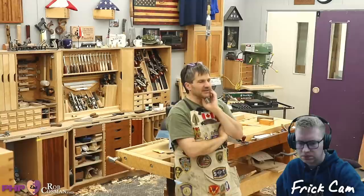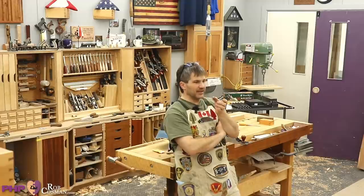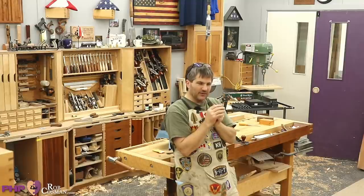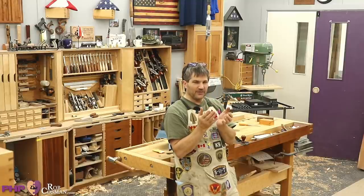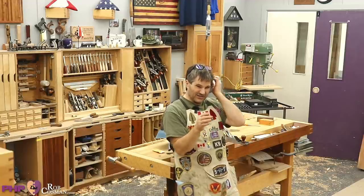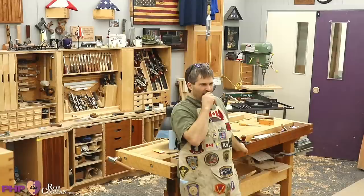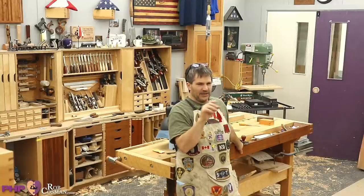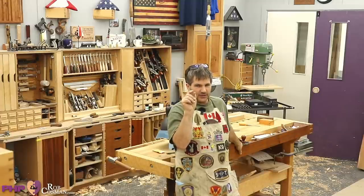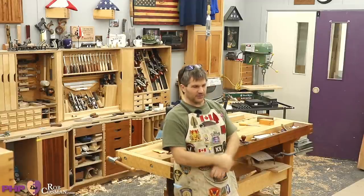The most common reason that I regrind, meaning work the primary bevel, is when the secondary bevel gets too long. Every time you sharpen, you're lengthening out your secondary bevel. Well, the whole purpose of a secondary bevel is to limit the amount of metal that you're having to polish. So as it gets stretched out, I find it faster to go over and regrind. Regrind by shortening. You don't go all the way through. I just shorten that or make that secondary bevel narrower so it's just a little wee tiny strip, and then start over again, and it speeds up the whole sharpening process.